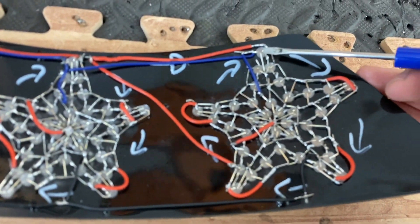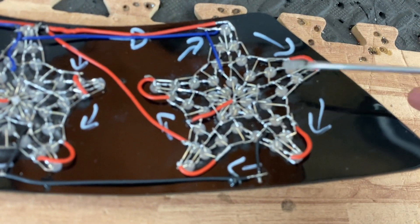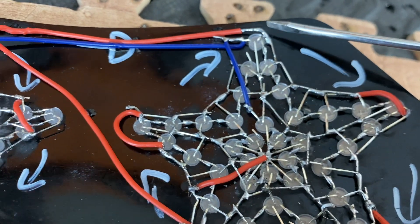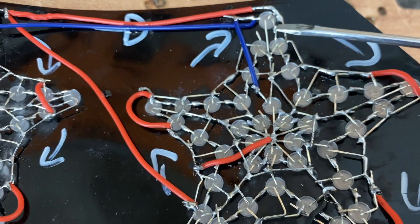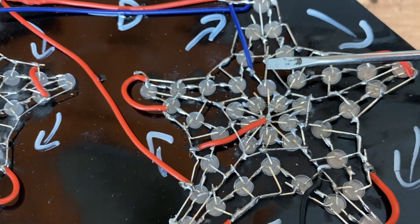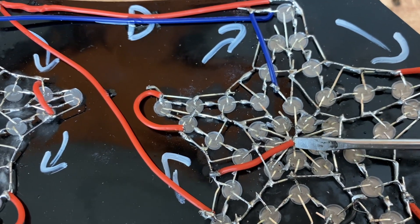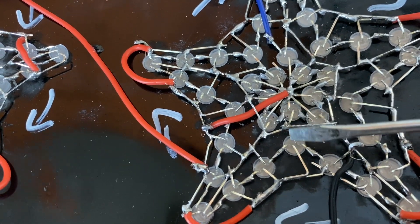Next up is the power pin. For the outside star, I was pushing power to the outside on all of them. For the ground, the ground pin was going right down the middle. Power is actually one of the easier ones to follow because it literally goes all the way around the outside. The ground is where it gets a little confusing — for the outside star the ground goes down the middle, but for the inside star I pushed the ground to the outside, so they all run together to one ground wire. For the inside star, the powers all run to the inside down to one point.